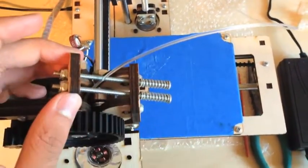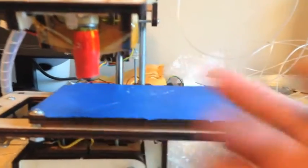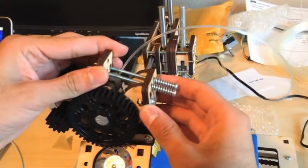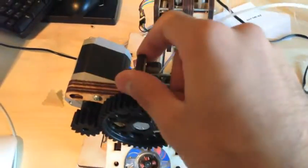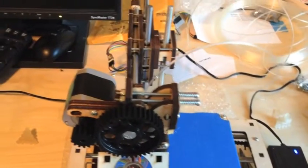So you're going to feed it through there, and once you're pushing it in, it's going to start dripping out. Right now it's not hot, that's why I can touch it. You have to feed it in and push it, and once you see the plastic is coming out, you know it's working. What they actually failed to explain: you're going to pull this so the little springs get some tension, and then you're going to put it over the wood so it sits flat. Once I fixed this, I actually got it extruding properly - something that was never really explained in the instructions.